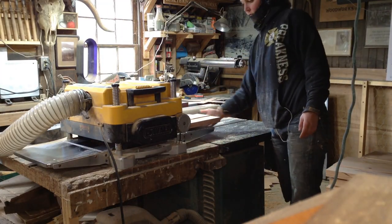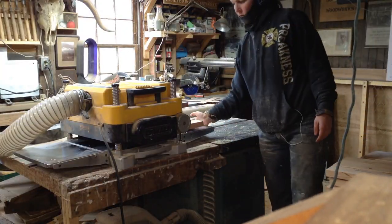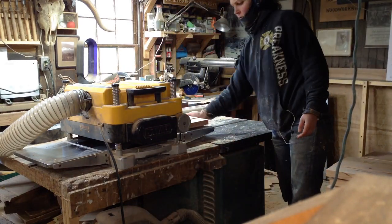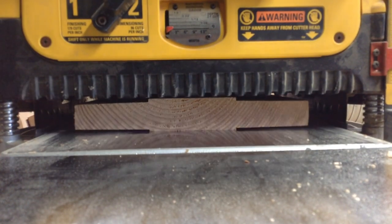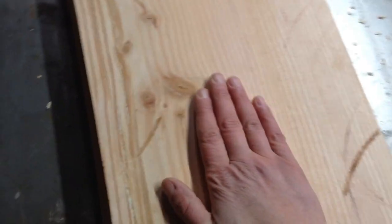The other reason I chose Douglas fir is because it's going to be painted - there was no point in making it super nice. The originals were pine and lasted quite a long time, and these are decorative corbels - they're not holding up weight or anything. They're going to be under an awning and not really subjected to the elements as much as something out in the open. If these were going to get a lot of sun or rain, I probably would have designed this a little differently.